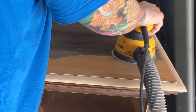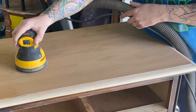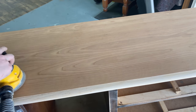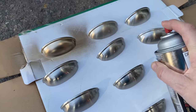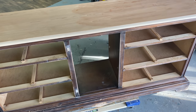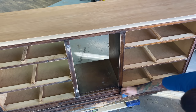I'm leaving the top bare wood, so I'm using 100 grit to cut through the old finish, then onto 150 grit to smooth that out, and lastly finishing with 220 grit. I also have these new poles but I'm not a fan of the colour, so I'm giving them a light coating of champagne coloured metallic paint. Then I'm just giving everything a quick wipe down so all the sanding dust is gone, because I'm getting ready for paint as well as stain.